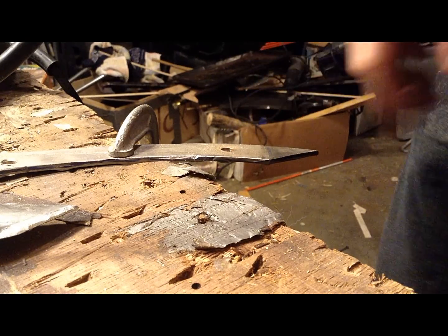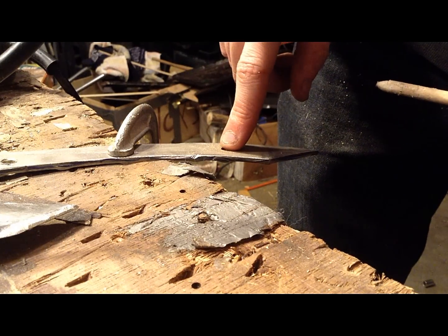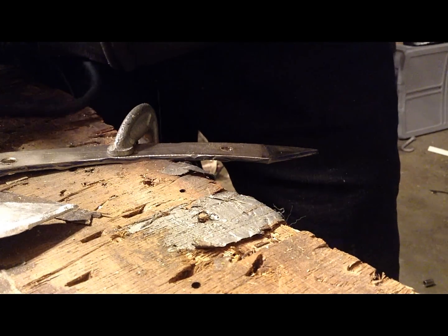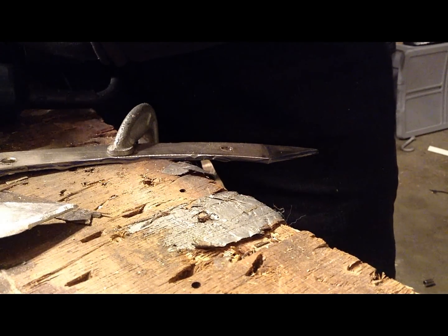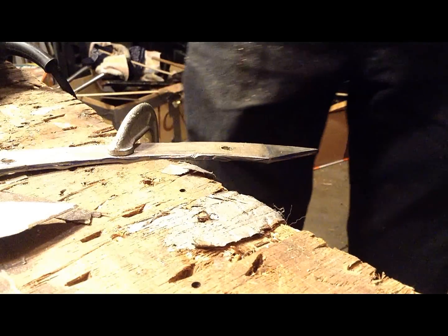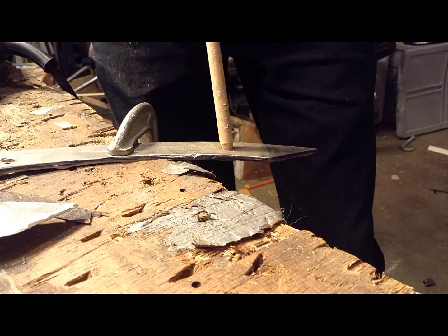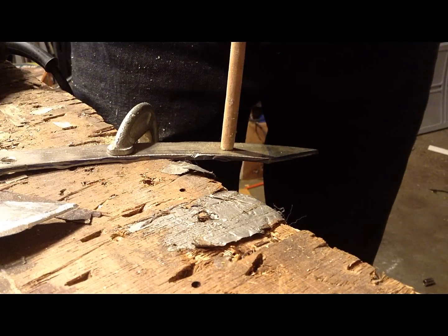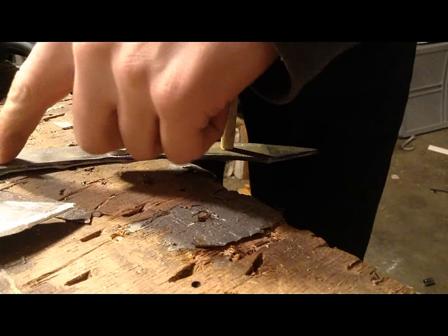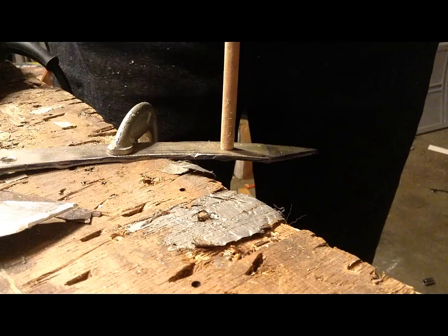For the drill bit, I thought I had some pins that size but I don't. I do have a dowel rod that's about 5/16ths, and I drilled the hole with a 3/16th inch drill bit. To make 3/16th inch pins, I'm going to take the dowel rod, put it in the drill, then just put it in the hole and start drilling downwards. As you're drilling, it will cut the dowel rod down to the same diameter as the hole, so you'll have a pin that's the exact size of the hole you drilled.